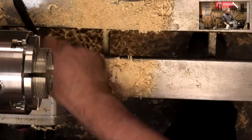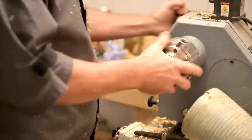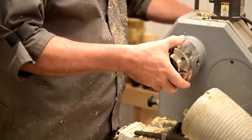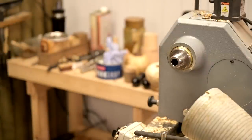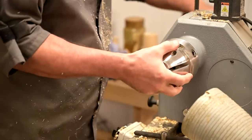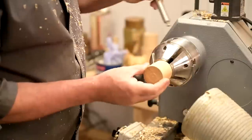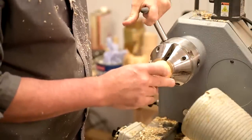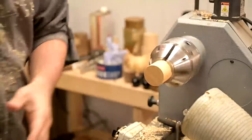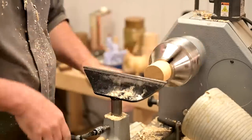and we'll put our bit of timber in for our thread. I have prepped all of this timber because I realized this is quite a big project, and I didn't want to overrun too much. So I've prepped it to hold in the O'Donnell jaws, and I've got a little bit of satin wood for our little thread. So all ready. It's going to fit into the O'Donnell jaws. Clean off that front face. All I've done is rough it down and made a clean back to it so I can hold it in the chuck.